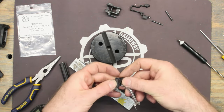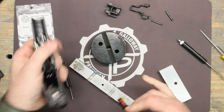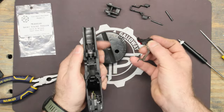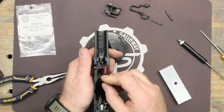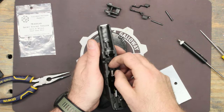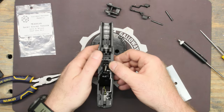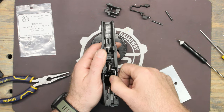So when you spring up: small end to the back, fat end to the trigger. The finger — the thumb on the trigger bar — goes right back here. Drop the trigger in and make sure the spring is oriented good. If it's bound up it's a pain, so just make sure it's seated. You don't want it hanging off to the side. You know the trigger bar is right when it's up against the wall, flush like this.